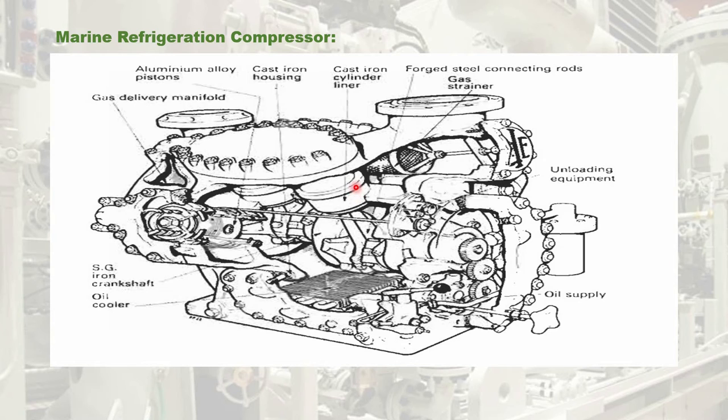After cooling the parts, the oil starts dribbling back to the crankcase. While dribbling, a very small amount of refrigerant also dribbles into the compressor crankcase. In the next cycle, when the compressor cooling oil is taken to the suction manifold, the refrigerant that dribbled into the crankcase is also taken into the suction. This way, the cooling oil circulates between the suction manifold and the compressor crankcase. Since the refrigerant operates at lower temperature — around 4 degrees at the evaporator outlet — it cools the oil, so no extra coolant is necessary, and the oil cooler radiator is not strictly required.